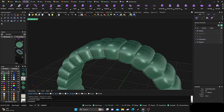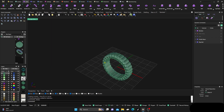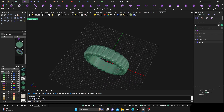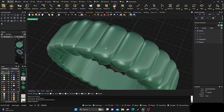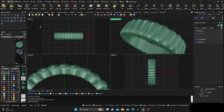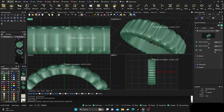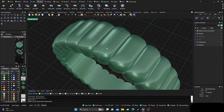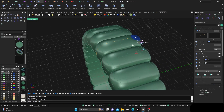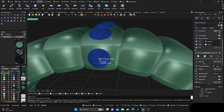That's the basis of our ring — not a bad band by itself, but we're going to do a bit more. We'll extract an iso curve, hold down Shift and Control to select the one in the center. Then go to Gems on Ring Rail, select our extracted curve, select the target surface again holding Shift and Control, and bring those gems on.